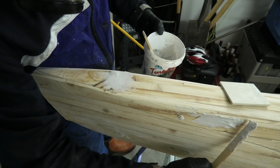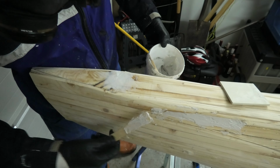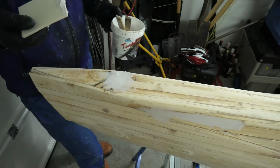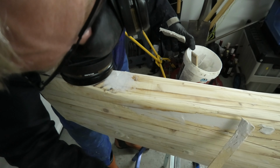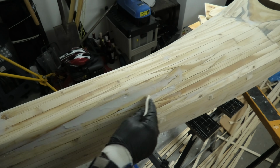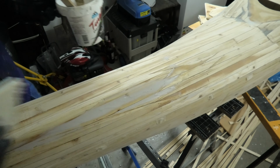The larger voids on this side are my main focus. As I have roughened up the surface with the sanding, it's relatively easy to get the fairing compound to stick. Although it's hard to get a smooth surface on the first stroke. Large fills are harder to get nice directly.